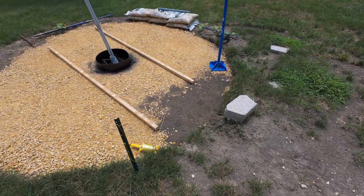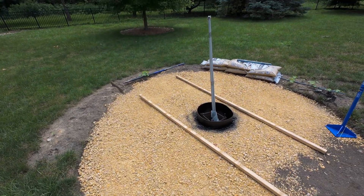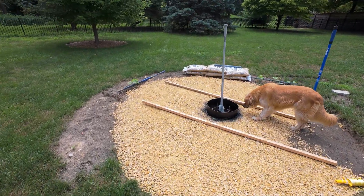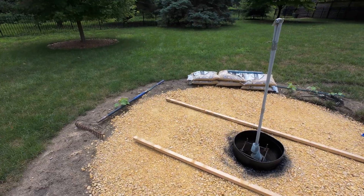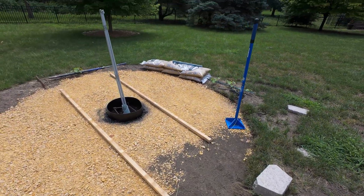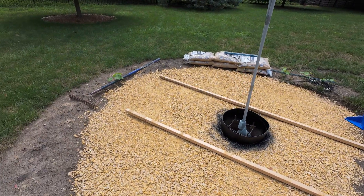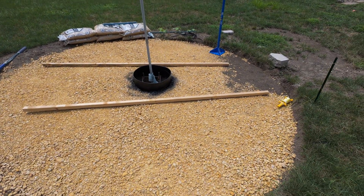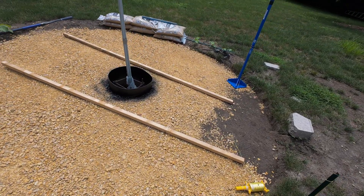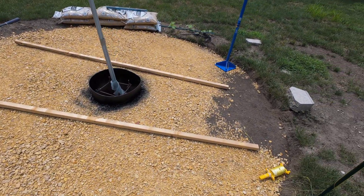You can see I've had some wash-in of dirt here — I'll get that cleaned up, it's just right on the surface. But this is the pad we've got, and it was really out of level. Over here by where the rake is, that's about eight inches deep, and we're about six inches deep on this other side — a lot more gravel than I had planned on. Honestly, at eight inches you'd be able to drive a car on it. On top of this is going to be pavers that I'll be setting in with polymeric sand to lock them all in, but we'll get to that in a later stage of this project.